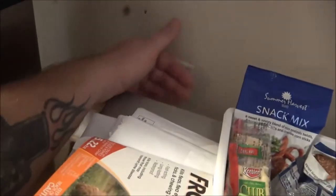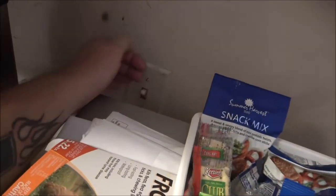So the first thing we want to do is kill the power and take this light down. So I got to get my tool out and check for power. And this is what the cover, that blank cover, is going to go over. The switch is coming clear out, so the cover will block that off.